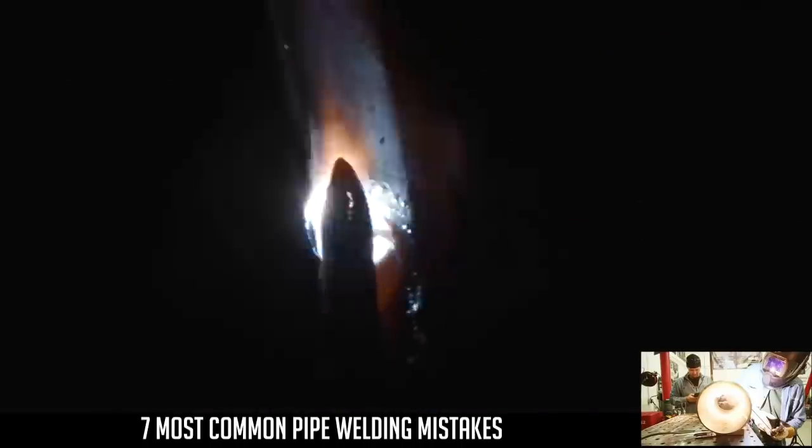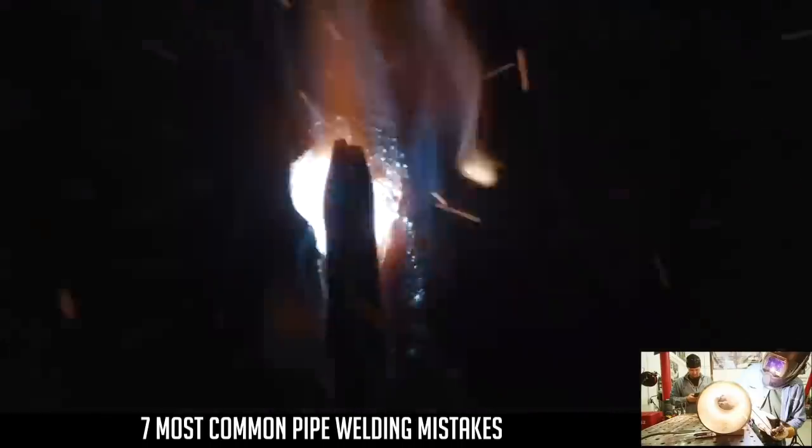It's like the weld pool is just laying in the groove. It's not doing anything. It's not impressive. So that was EN — to me it looked softer and quieter. Should be crowned up about the same, maybe just a skosh higher.